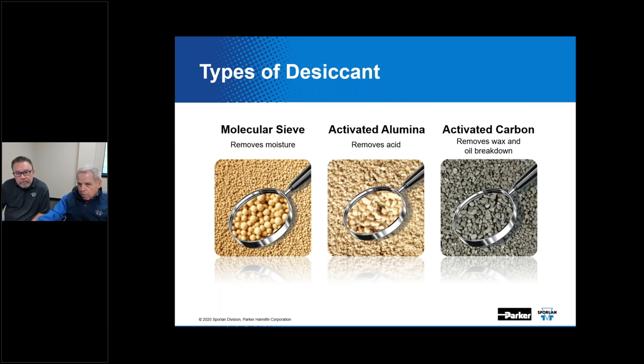Don, you have to keep pointing those out to us. For some reason, it's not showing up nicely for us. Well, there's one more before you pass on and talk about the types of desiccants you have. So here's the other question that I see posted. It says, if I'm evacuating a system, will the moisture pass through the filter dryer and be taken out, or will it be trapped in the teeth of the filter? But you know, it's in the desiccant, right?